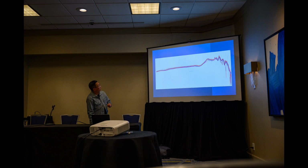But what I'm saying is that the response of the squishy canal, the possibility of not getting a seal, having to throw away 12 of the 44 measurements, the 32 that were left, and the fit that they made, I don't know how representative that is of the average. Again, I think a leak would be represented pretty clearly. The other point is we may understand the mean, but we don't have a really good grip on variance, which means we don't know how useful these measurements are to the average person, or the random person rather, that picks it up and looks at the graph.